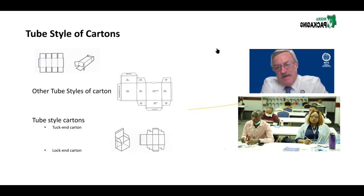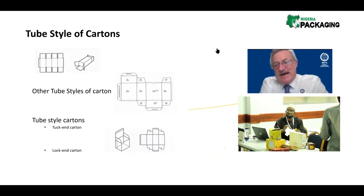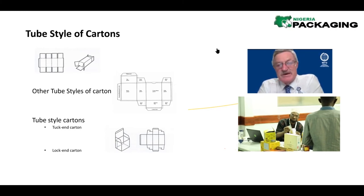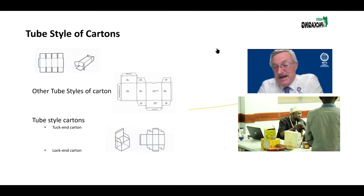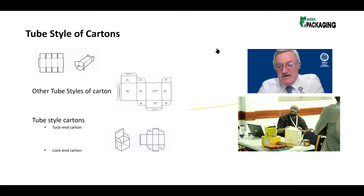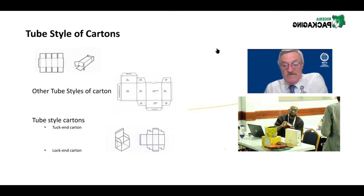The reason for the alternate tucking end design is that when you lay the blanks out on a sheet of board, one fits in like a jigsaw with the next one, wasting much less paperboard. Some cartons use a tuck end, lock end, H-lock, or crash lock. These locking ends are used for products like tubs of hand cream — the lock prevents the contents from falling through the bottom. If there's no proper lock and the weight is too great, it will fall right through.